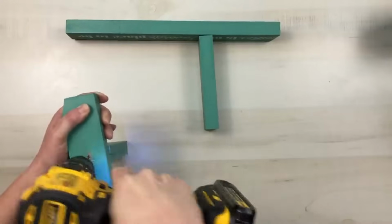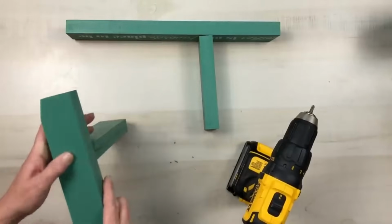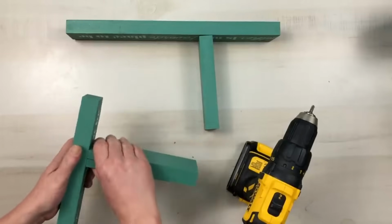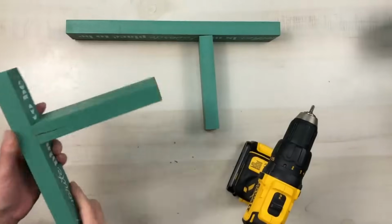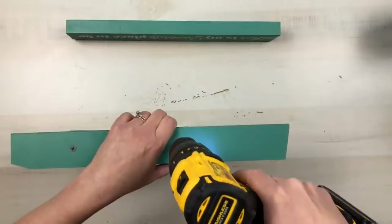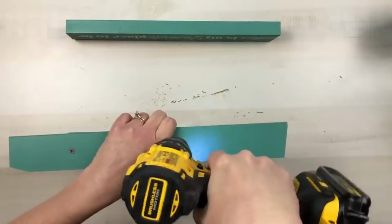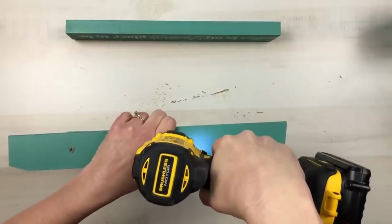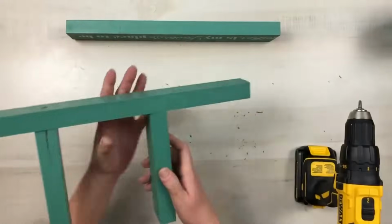And so see, it cracked and it split right there on the two outside edges on that side. But again, it's pretty sturdy, so I went with it and just went ahead and used it. But I did go ahead and change my drill bit out and went over all those previous holes to make them larger. Once I had those larger, I went in and added the second piece to the middle of the ladder. And this worked perfect, so this piece did not crack or split.